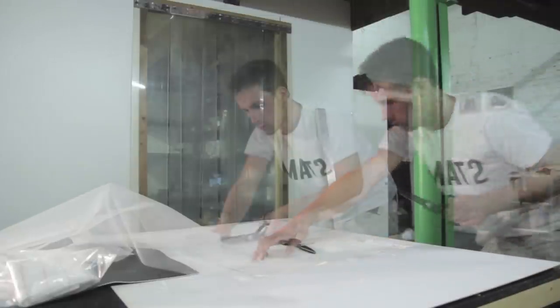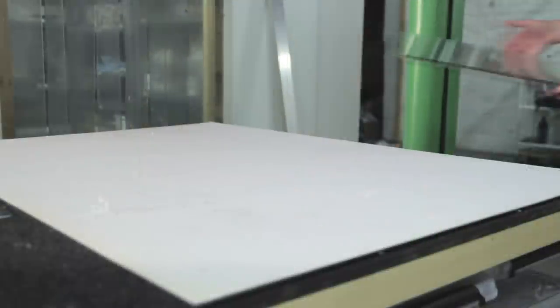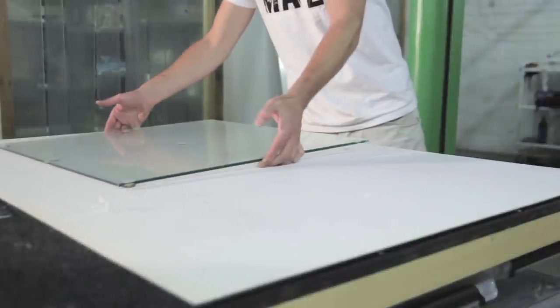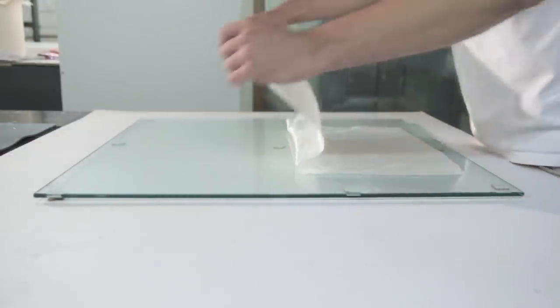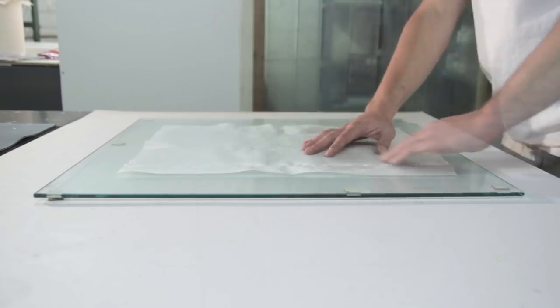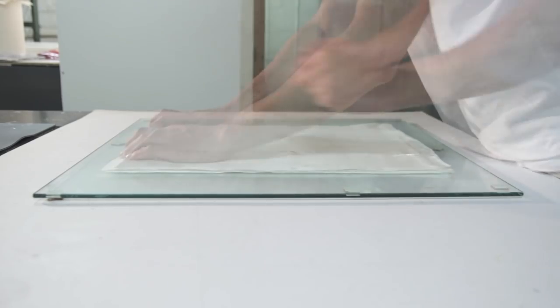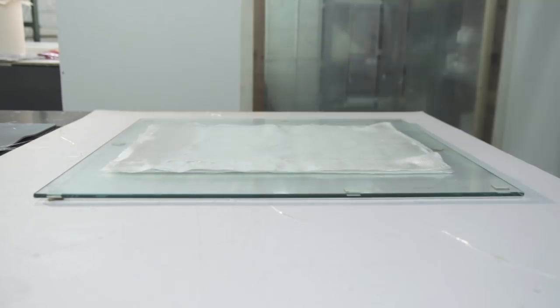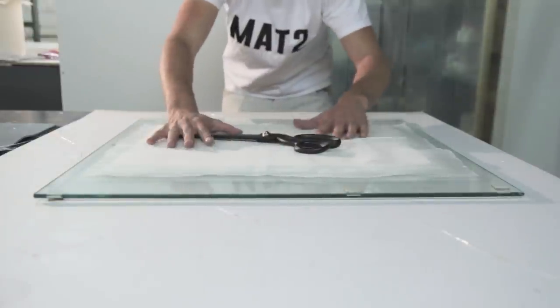So take some good precautions while cutting everything out, and clean your cuts just so you have good results, because the vacuum bagging and the tape will come all the way around, and just make sure that you have enough space to put the vacuum bag all the way around. So here are the 2 layers, then there's the core, and then on top you will see 2 more layers followed by some peel ply and infusion net.